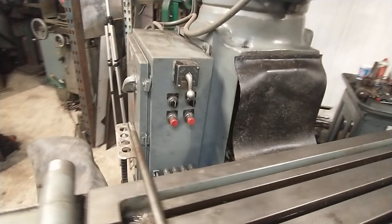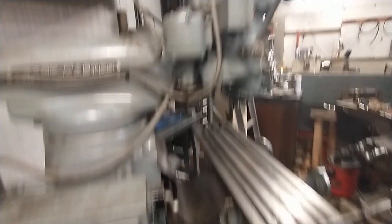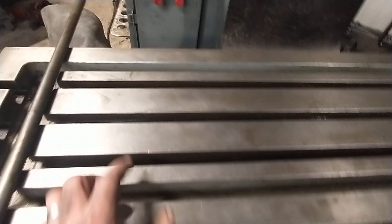It's wired right in with its own control — coolant, mist on and off. It's got an automatic oil pump in the knee. There was some rewiring to do because this thing was originally set up for 208-volt control and I'm running 240 volts, so I had to go in and bypass the transformer, which was a 208-to-240 volt converter. I bypassed that and I've got it wired for low voltage on the motor right now.